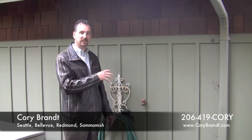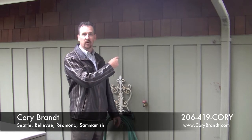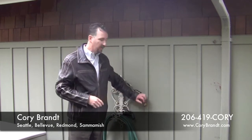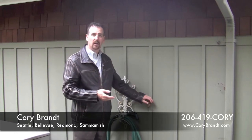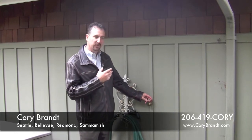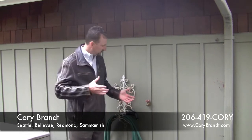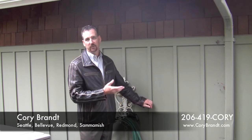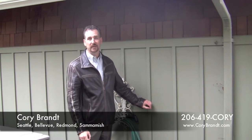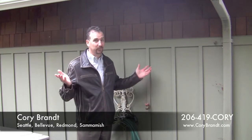Now, if you have a shut off inside of your house like I do here, I go in the garage, I turn the hose off from the inside, and then I open this to drain the water. I haven't winterized this yet, so the water's still on. But if you don't have a shut off inside, then it's good to go get those styrofoam nipples. You put it over the top, takes the heat from the house, stores it next to the spigot, and helps prevent it from freezing. This works in the Northwest. It's probably not going to work in Minnesota where it's 20 below, so keep that in mind.